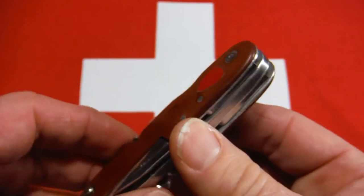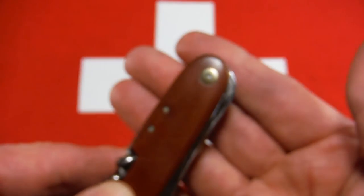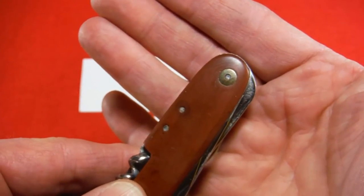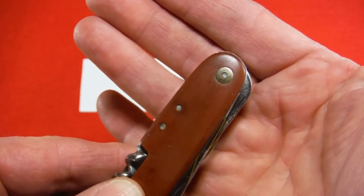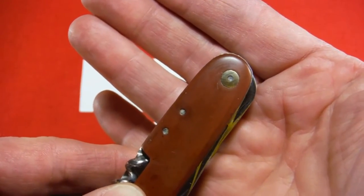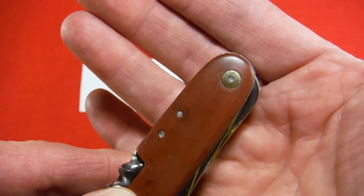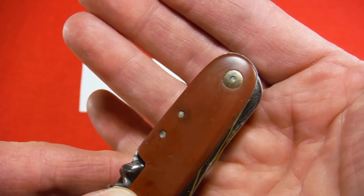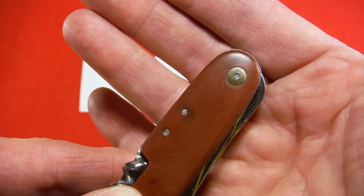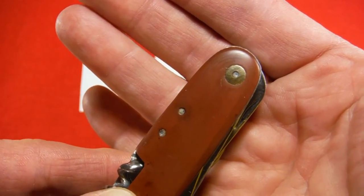The biggest challenge was this missing brass bushing back here, or collar. And, you know, I thought at first I'd be able to just get a couple of brass washers and put down in there. I couldn't find the right size. They're not thick enough. And the problem with the washer is the holes are always too big. See, that pin just occupies about a third of that outer diameter space. And a washer, it's about a 50% ratio, about half hole, half washer. So that didn't work out.